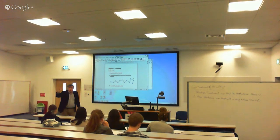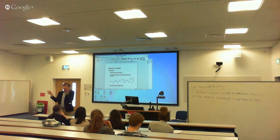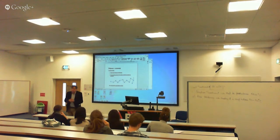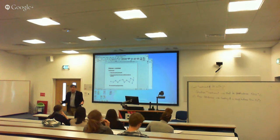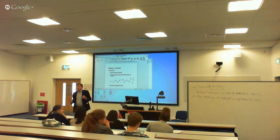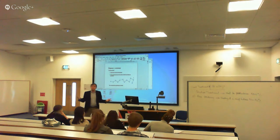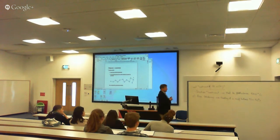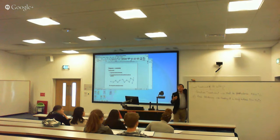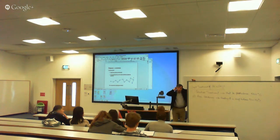You do need to know the density of aluminium, roughly, and why you use aluminium: because it's light, it's corrosion resistant. And yes, if you do the right heat treatment, it can be strong. It is a lot more expensive than plain carbon steel. It's non-magnetic, depending on the grade. Some of them can be easily shaped. Some of them can be quite strong and tough.